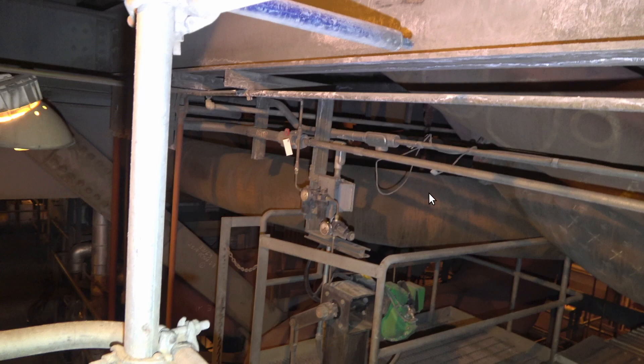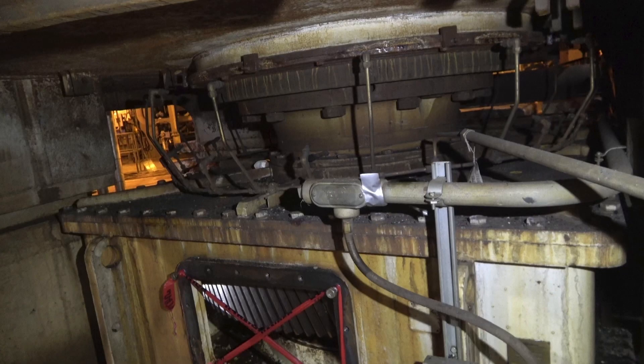From the air box, the air drops down and goes into the bottom of the pulverizer. These are coal conduits going up to the burners — about a 20-inch line. The gearbox is down below. Up here are spray nozzles; when you grind these out it minimizes the dust. If the mill trips offline, you have a lot of coal left up above, so an operator has to go down, inert the mill, start it, and then the coal gets worked out down the air vents to the scraper box and down the pyrite hopper. You have to sluice the coal out — you can't leave coal in these; it will start smoldering.